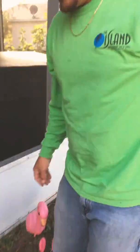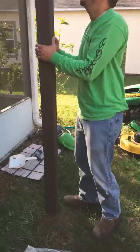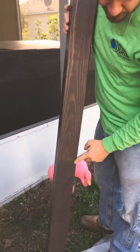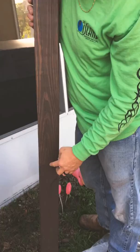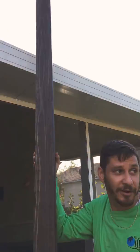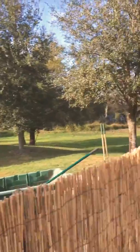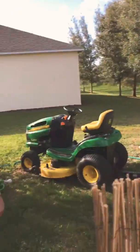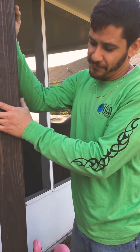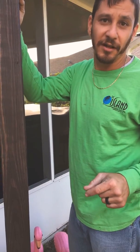You can finish it. I already got some posts — I got lines indicating where I wanted the top part of the post to be out of the ground. Make sure you measure from top to bottom if you're trying to pair up posts to be equal. Not all posts are true at ten foot like these are — that one's probably about a half inch longer.